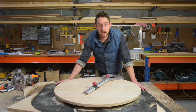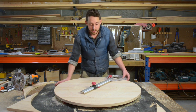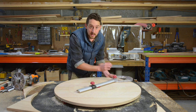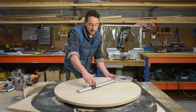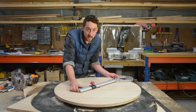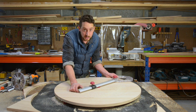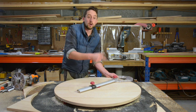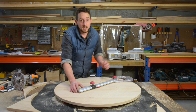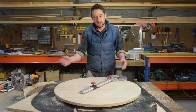That last pass just really improved the quality of this cut, so I think that's probably a necessary step. What I had to do to get the router bit engaged with the edge just the tiny amount needed is start with this unlocked, with the router bit just off the edge, and then while firmly holding the router, just bring it in so it just touches — you'll be able to hear it — lock it off and then go around. You can't start the router up when the bit is already engaged because it'll act as a gear and either rip the timber or worse.